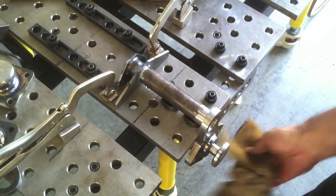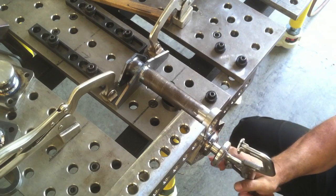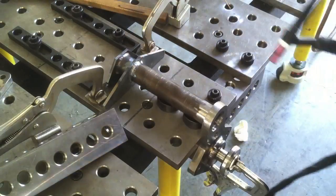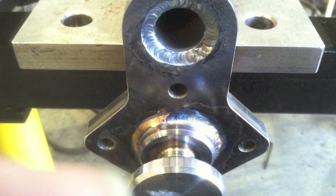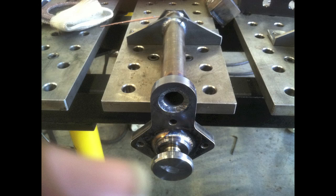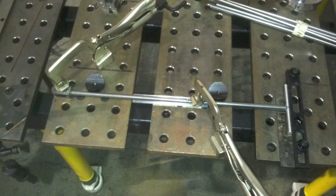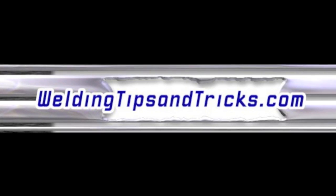When that's all done, the last thing to put on is that thick piece — that boss — we just welded. It's actually going to go into some kind of hoist to lift a really light part; it's kind of overkill but it's for balance more than anything. Using that riser block again to square it up, I've already checked my distance, getting some tacks on there, then weld it all up. That's what it looks like when it's done — four of them, a good night's work. The next day I had about 50 of these things come in the door. Again, a very small part on a big table, but still very handy to fixture them up and weld them all. That's it for today, thanks for watching WeldingTipsAndTricks.com.